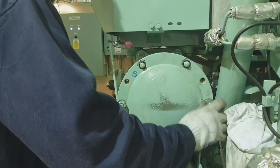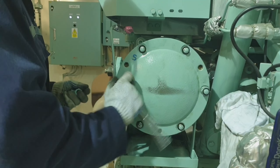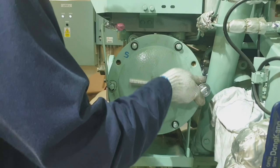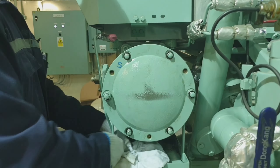As part of the third engineer's job, this replacement of the lube oil duplex filter is very important, since it has a lube oil pressure trip. Before reaching that trip point, it gives you an alarm which is the differential pressure high. When you receive the differential pressure high alarm, that means we have to replace the duplex lube oil filter — that's how important this kind of job is.